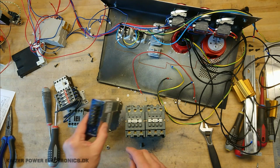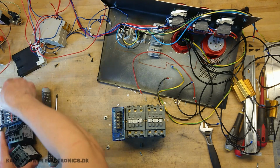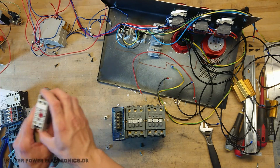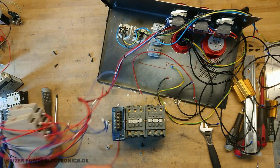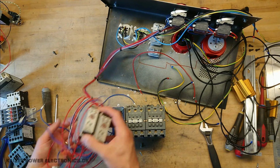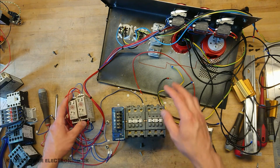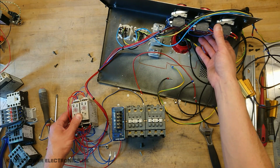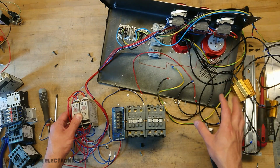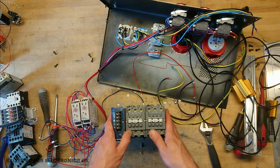So we're also going to use the power supply. Away goes 4 contactors, and away goes 2 timers. So I'm only going to use one of these Omron timers here. It's going to be an on delay timer, and then we are of course going to use some of these switches. So a bit more disassembling of all this, and we can start making out which parts go where.